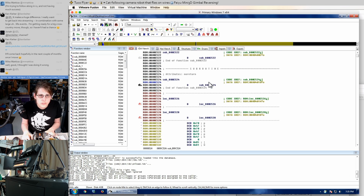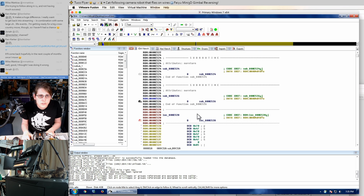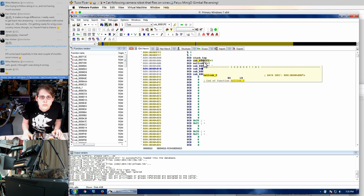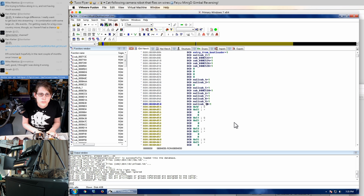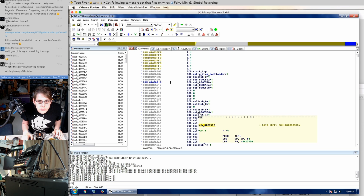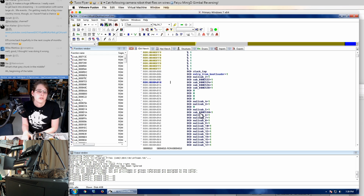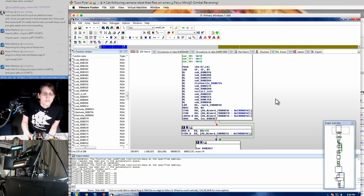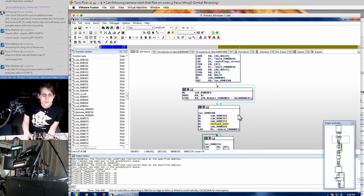This is looking right so far. These are all interrupt handlers that just go to infinite loop stubs. More functions. A lot of unused entry points. So a lot of these are probably boring. One of them is probably serial and is probably going to buffer stuff in a queue in RAM, and then something maybe in the main loop will handle the commands. I wonder if this is the incoming serial port and the one down here is the outgoing serial port.